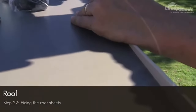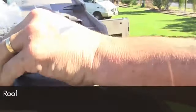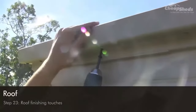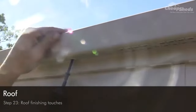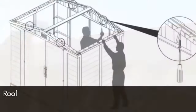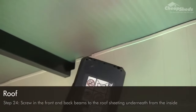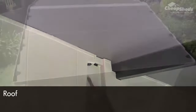Remember to stop and check the manual regularly so you know you're on the right track. In step 23, add the finishing touches to the roof — the roof has a slight overhang, so use 12 screws along each side to secure it to the shed. In step 24, screw the front and back beams to the roof sheeting from underneath on the inside. And that's your roof complete.